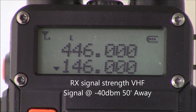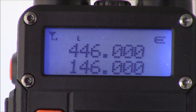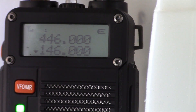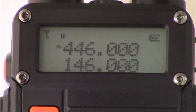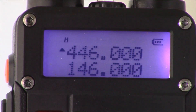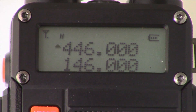Ebre antenna collapsed. Ebre antenna extended. Smiley 5/8 wave duck — signal intermittent. Nagoya 771 — signal intermittent. Survival Comms exotic VHF receive. Nagoya 771 on UHF. Motorola monoband UHF. GAM antenna UHF receive. Ebre 42 and a half inch antenna at UHF. Ebre 42 and a half inch antenna folded at UHF — signal intermittent. Ebre 42 and a half inch antenna, resonator removed — signal present.